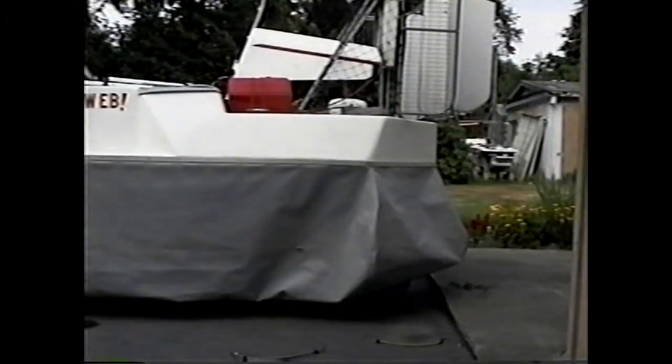An SEV can run over rocks that are the size of a softball with occasional football-sized rocks thrown in, and if the SEV carries itself at a good height and if it has a compartmented skirt, you can merely swallow the entire trailer as you have seen here. All I did was add 4 ordinary boat trailer rollers to the rear of the trailer, and since I can roll the forward part of the machine onto the trailer while the aft part is still pressurized due to the partition skirt, this machine will go on this relatively high trailer with very little difficulty.